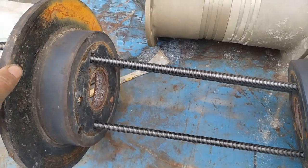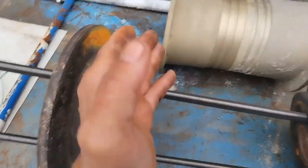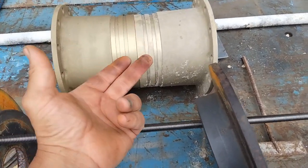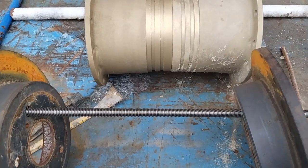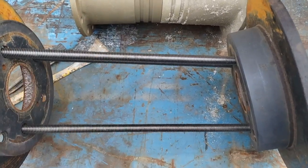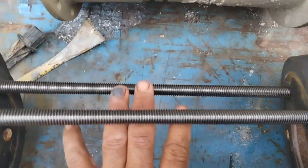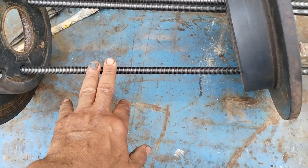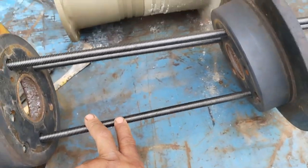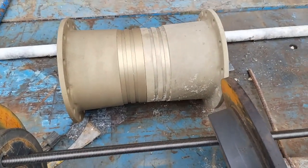This is what it would look like roughly. This is your interface ring - this could be a full interface ring though, it could be partial, or we could have it full, fully down under compression. You've got to worry about buckling it - that is an issue I have. But you would put strain gauges on this; this would tell you what's going on with your vessel. Strain gauges on your bars, and you'd be surprised what bars you could probably get away with using. You would just have to protect them from the elements or any cathodic reaction, the galvanic reaction - it's not being used as a cathode.